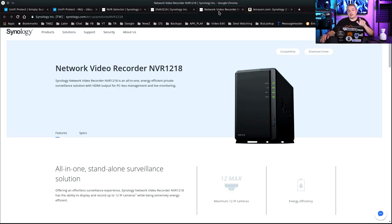They also have a feature I was really hoping UniFi would have a solution for: people want these put on a TV. I know there are workarounds using RTSP streams and a Raspberry Pi, but now you've built a project you have to support, rather than just plugging in an HDMI cable and connecting it to a TV so they can watch their cameras. Synology has that option. For larger NVR installs — like 100 cameras — they have entire kits that plug into the NVR via network interface to remotely watch on a TV. They basically create their own system with a direct TV interface, or you can watch on a computer with a Windows tool. They've got hardware and software solutions for many different scenarios.